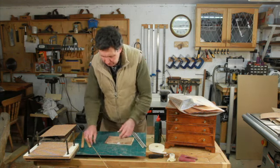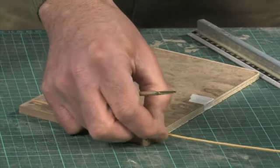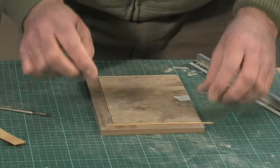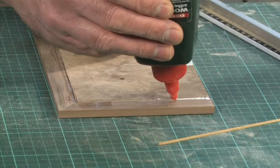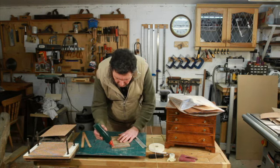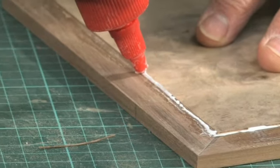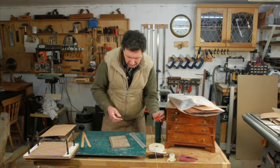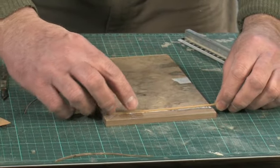Now, if we take a length of the stringing, let's cut it slightly over length. Don't worry about squaring the end off yet. What we'll do is get the PVA just in there, just against the ridge, and we'll just run the bead. Doesn't need a lot. Down the edge there. Now, the stringing and just push it, butt it up